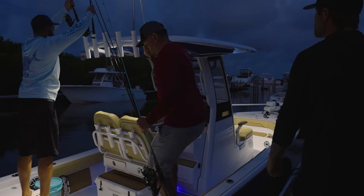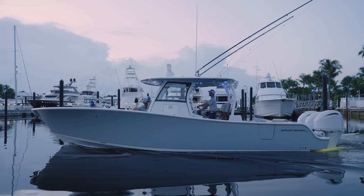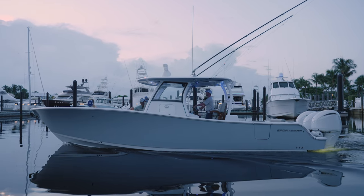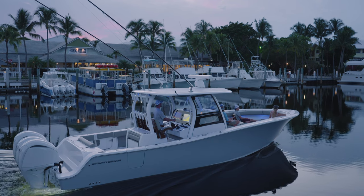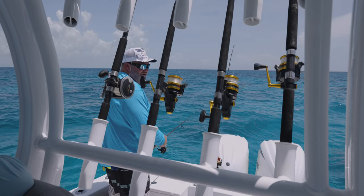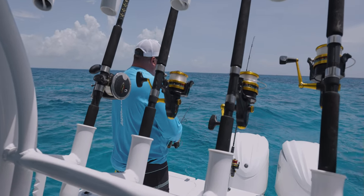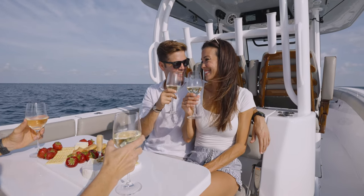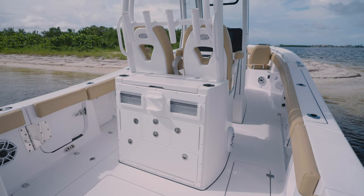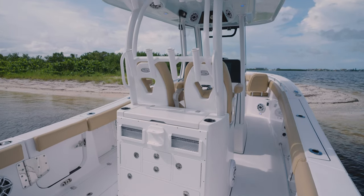In addition to lights, modern electronics and joystick systems require antennas that will be mounted on the top, as well as optional equipment like radars. Wrapping around the back, additional rod holders and support is also typically seen, depending on the size of the top. The rear legs are added on the larger models for additional structural support. These rear supports lock in the top in 6 spots and stop any movement, even in the roughest conditions.